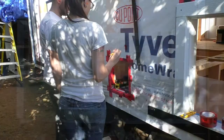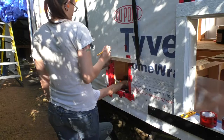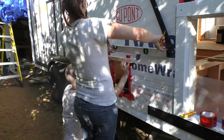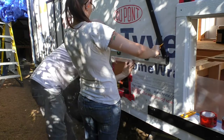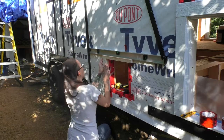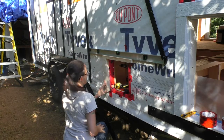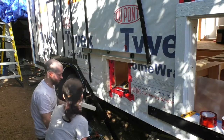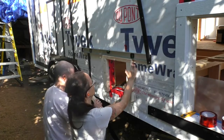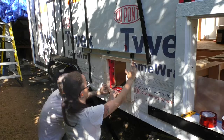The last pieces of trim to consider were to go around the water heater and the various vents around the house. For this, I decided it would be best to attach these trim pieces directly to the house wrap and caulk the whole way around it. The way I saw it, if water was to travel behind the siding down to a vent, I didn't want it traveling through the perforated rain screen and settling on the vent itself. I'd rather it hit a painted piece of trim and evaporate from there.